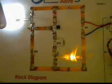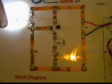In this dark condition there is no light, so the LED is off. When we allow a light source to come in, it becomes bright — resistance reduces, voltage VB increases, turning on the transistor, allowing current to flow through and lighting up the LED. When the light source is removed and it is dark again, resistance goes back up, VB is zero, the transistor turns off, and the LED is off. Thank you for watching — I hope you've learned something about how a light dependent resistor can be used as a light sensor.